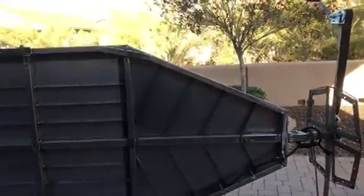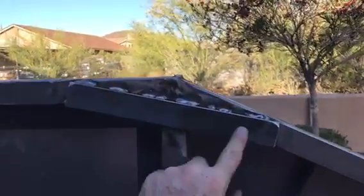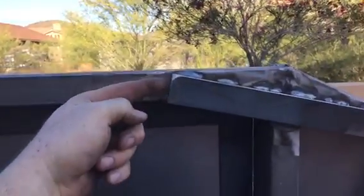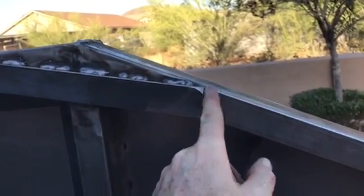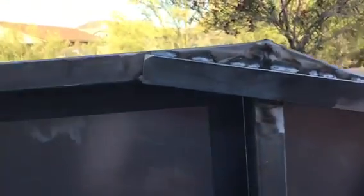Just doing a little update. I went ahead and welded these on — these are 12 inches. Make sure you do not weld the end pieces, because if you do, that's where the steel will crack since you're overheated and it'll fracture. Just weld the sides, and you can weld up here too if you want.